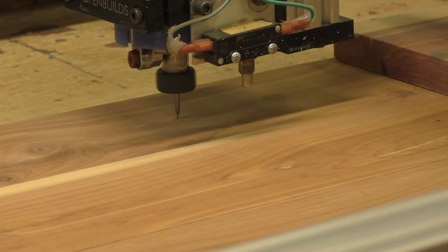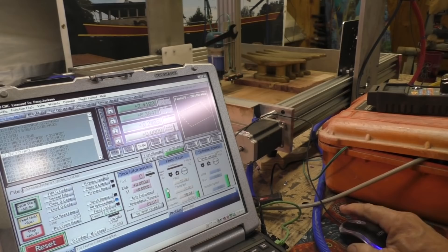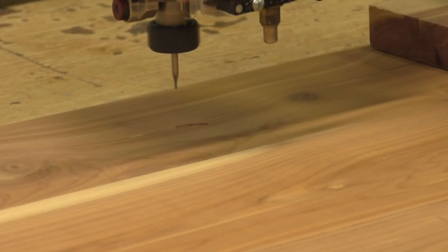Now that I like what it's doing, I bring the speed up. I'm gonna run this at 50 percent. Again, that long Z axis means we've got to keep our speeds down. Looking good — we can go off and do something else for the rest of the day. I don't get why people building home-built machines try to make them run crazy fast like production machines in industry. It's not like you're putting out 20 units today — you're probably just doing one or two and you're not gonna run your machine for weeks. Think about the variables that are yours rather than the industry's. When you build something for yourself, think about what you want, make it yours — and I think you'll be a lot happier with it and you'll also save a lot of money.